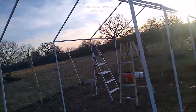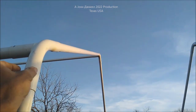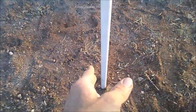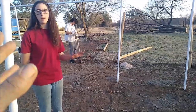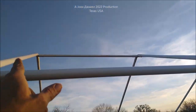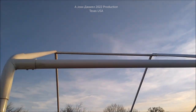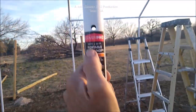What you're going to do is take this section here and bolt it — this is why it's 58.5 inches, because of this space — bolt it to this one in the center. You'll have double sets of legs going down, and what you end up with is a much, much stronger result. Your tarps won't sag in the middle because the spacing is so much less. Structurally, this will handle snow. We did this in Twin Falls, Idaho and it really handled a good foot and a half of snow without collapsing, even though all it is is this Cover Pro portable car canopy.